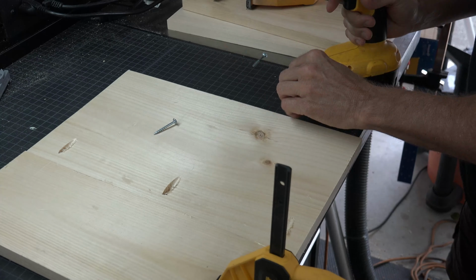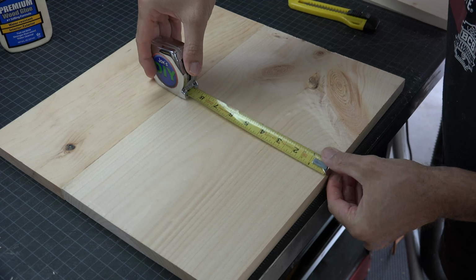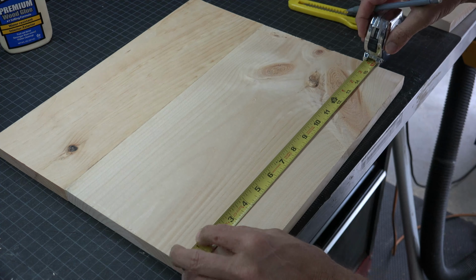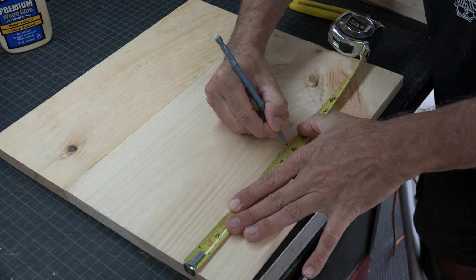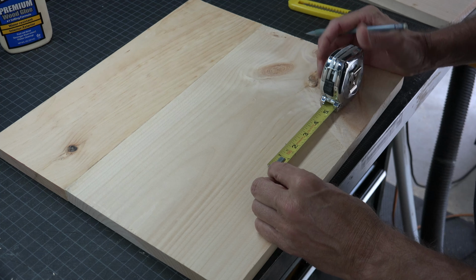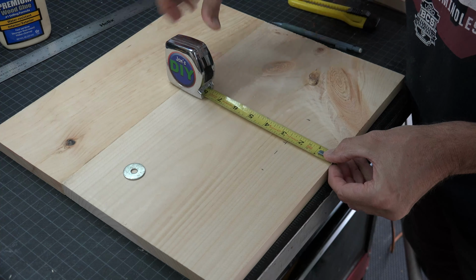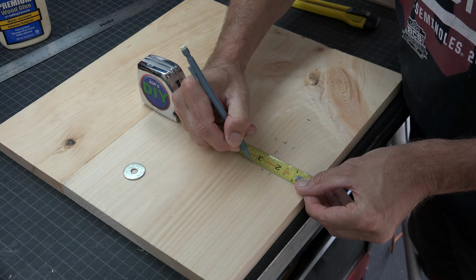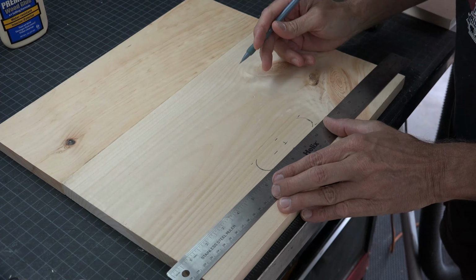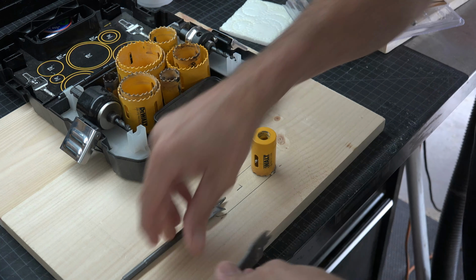You will do this twice and then add a little wood glue and screw them together. Measure down 2.5 inches from the edge and 8 inches across and make a mark. This should be the center if your cuts were 16 inches. Now measure out 2 inches from that center in each direction to give you a total of 4 inches. I'm going to give my handles about 1 inch in width, so I will place little guide marks before I round the ends. With a quarter or a washer, trace out the edges. Then join your lines. You will do this twice for each side of the nightstand.